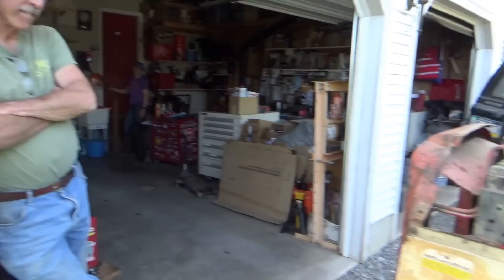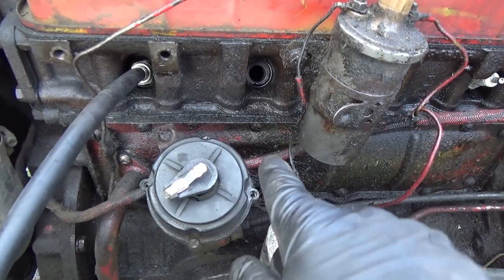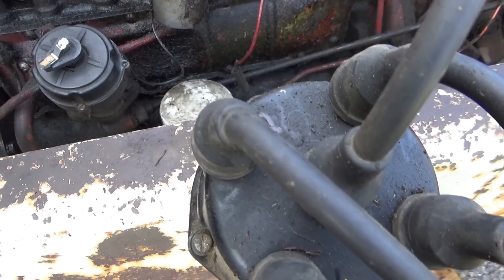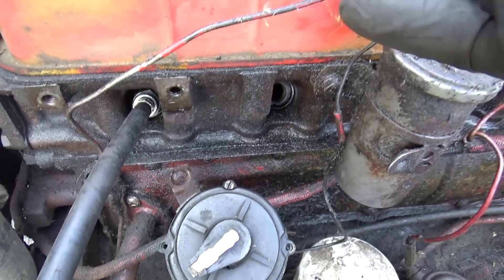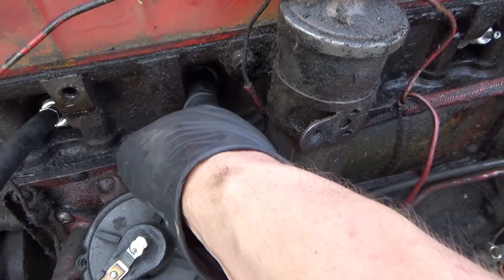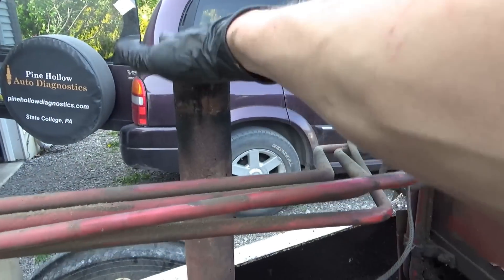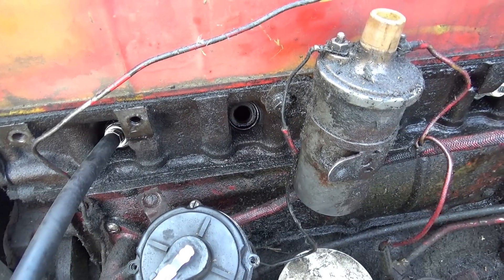Do you have bad valves and a bad head gasket, Harry? Yeah, this tractor's going to need some work — that's why I came to a professional. The explanation is: if you look at the firing order on the distributor cap, we have 1, 3, 4, and 2. So if we're on compression stroke number 1, where is number 2? Number 2 is at bottom dead center — it just fired, went down, and the exhaust valve opened. So basically we're leaking through the head gasket into cylinder number 2, but in cylinder number 2 the exhaust valve is open, so obviously you feel pressure at the spark plug hole and out of the exhaust pipe. So that's confirmed — we have a blown head gasket, no question about it.